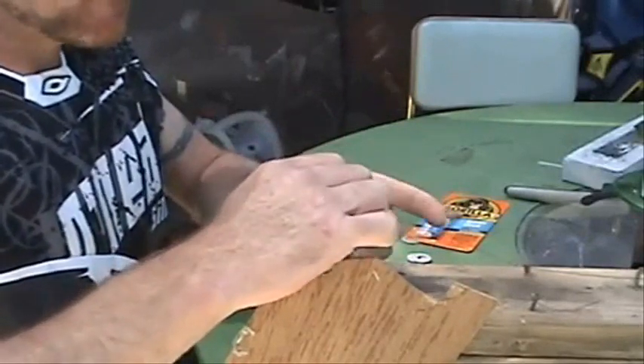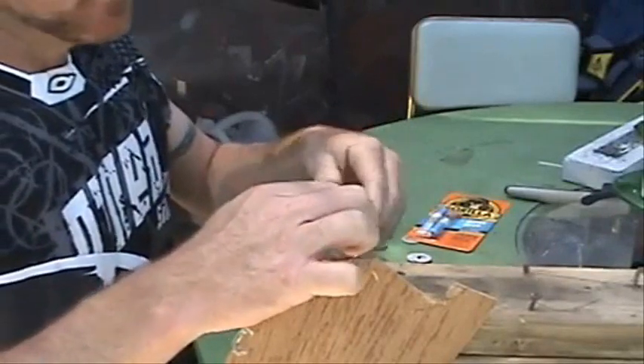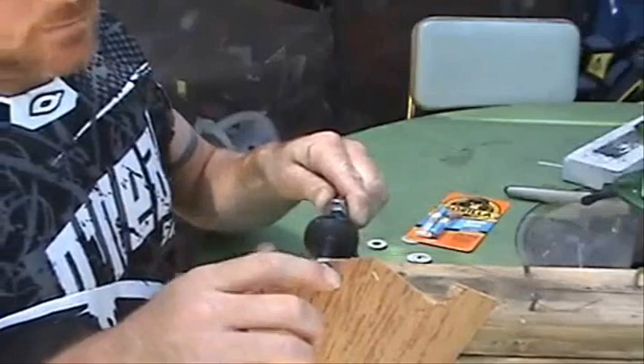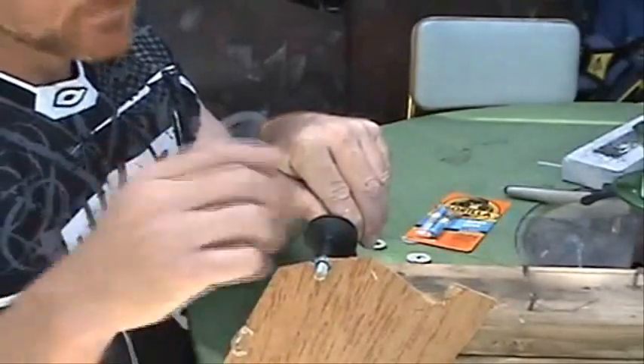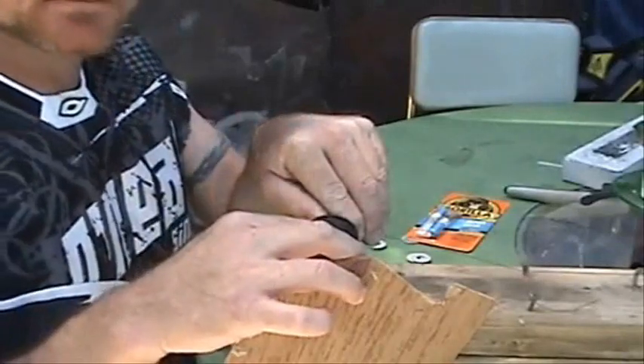Now this is going to create a thin coil with over a hundred turns. The only thing is I'm not counting my turns — the reason I'm not counting my turns is because I'm weighing each coil when I'm done. So this might take a minute, so cue music.